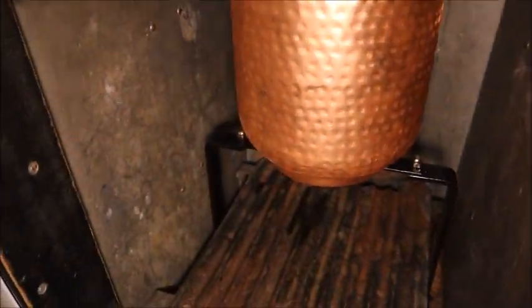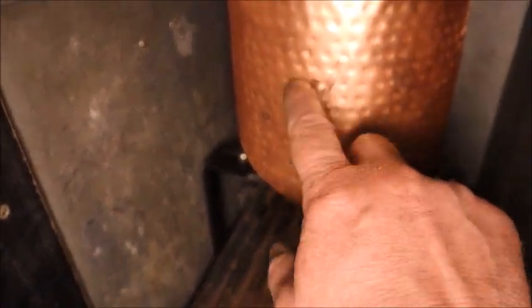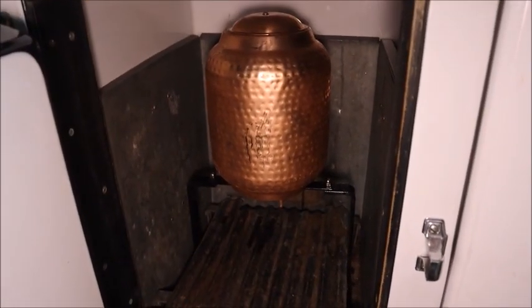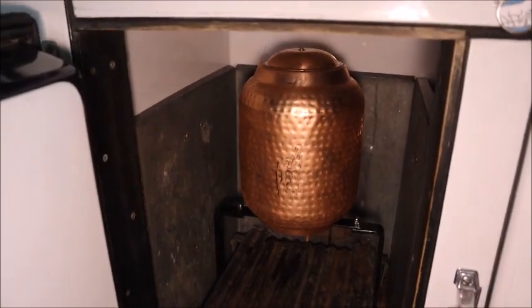Down to 1.75 amps and 155 watts; low-pressure side is about 25 psi. Been about 30 minutes of run time — just starting to get a thin film of ice on there. I like it, it's working. If only it had a thermostat we'd be able to see when it cycles off, but I'm going to let it run for a while and get good and cold.